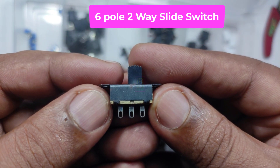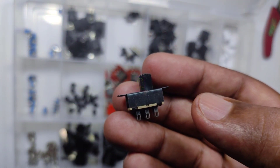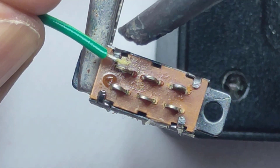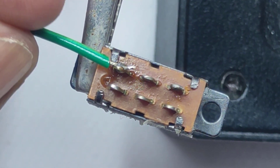Manual intervention is required for changing the direction of the motor. For changing the direction using pulses or digital input, we cannot use this one. Instead of that, we can make use of an H-bridge. I will make a video on that soon.